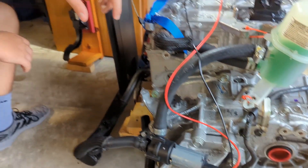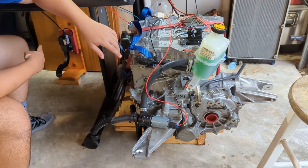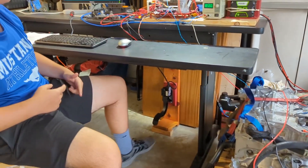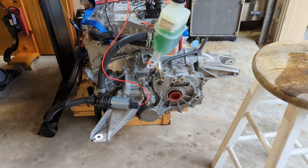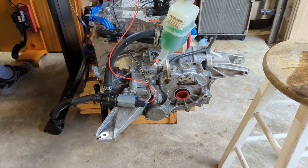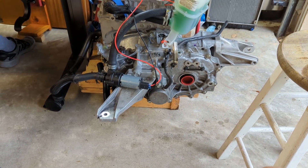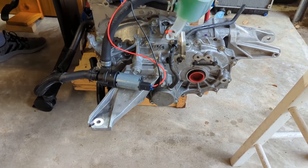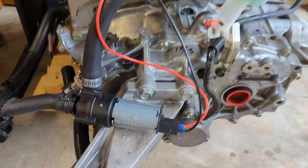We filled that up, filled the coolant up, and started to spin it at a little higher speeds. They said whenever we bought it that this was all drained. The tags said if it's a regular motor, the oil is drained — but of course it was still full. We went ahead and changed all the ATF anyway, and the little plugs with the magnets on both look pretty clean. There are very few metal filings on them, so the fluid was in pretty good shape. You can hear our pump running — it's pretty quiet.